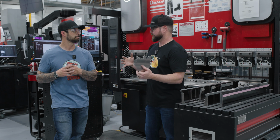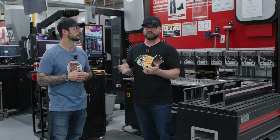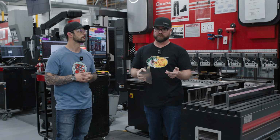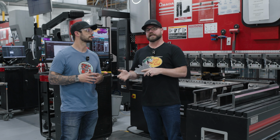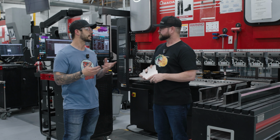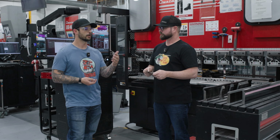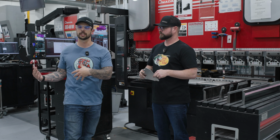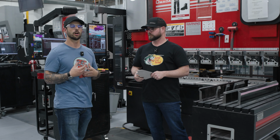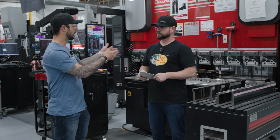So as soon as you upload and say go on the order, it's all programmed. We're ready to rock and roll on the floor. If there is a DFM issue, our support team will reach out and say, hey, our automated systems didn't catch X, here's a solution. We catch a lot of that during the programming process, and that's why there's a little bit of a delay. When your parts get cleared, the operator is going to pull that job in. The program's going to show up. All they have to do is pick the tooling that matches it, put the tooling in there, and go ahead and bend the parts.